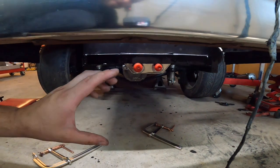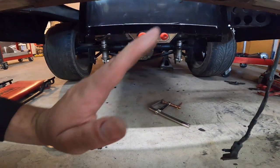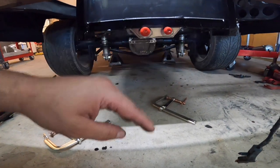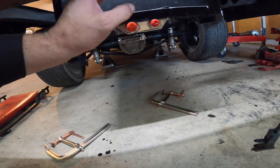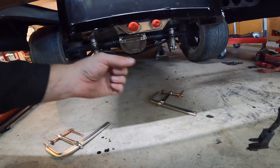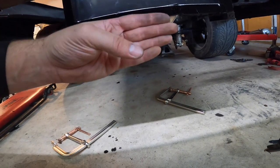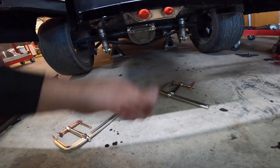So, but anyway, my pump, it's a pump on the top and then it's a gear drive on the bottom. So it's up and down, it's not horizontal. Like some of the Magnafuel 4303 is horizontal in terms of its mounting. And this is up and down, which is nice because the bracket that comes with it clamps on the top, so you can put that right into the side of that sheet metal. And then the bottom, like I did on the white car, where I took a piece of aluminum and I brought her down, and then where it clamps on the bottom, that way you have a nice sturdy thing.